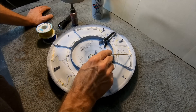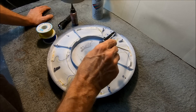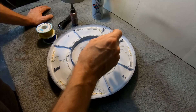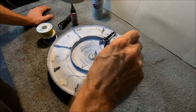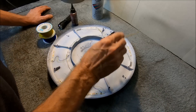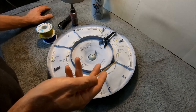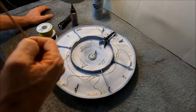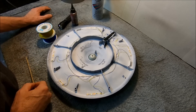Let's say we did have one of these fail — just that general area will be the only area affected. If you have this in series and you get some kind of a short, everything wired to that beyond that point also gets knocked out. So if I had this all wired in series all the way around the circle here and this one here was the first to go out, the entire thing would go dead, which would not be good. Somebody could maybe live with one window group going out — you could say that's an area of the ship that just wasn't lit at that particular time. But if the whole thing is dead, that's a big problem. That means you're cracking the model back open to repair it and probably doing a lot of damage — probably better off just building a brand new model. So that's my reasoning for wiring in parallel.